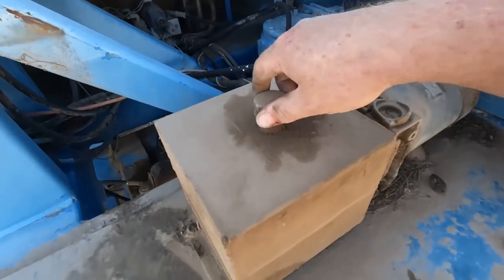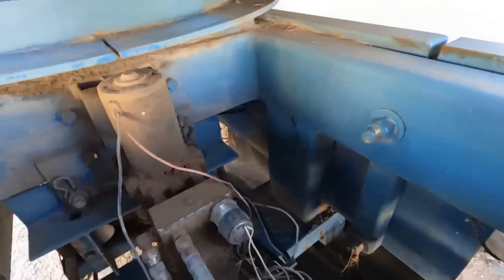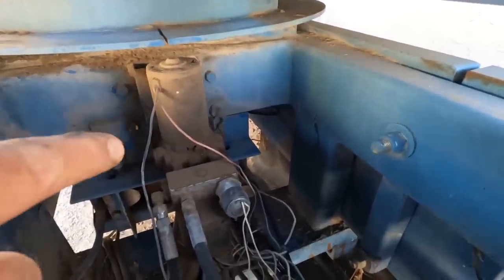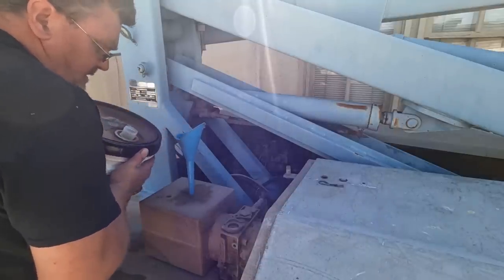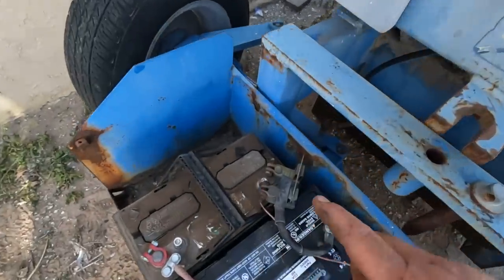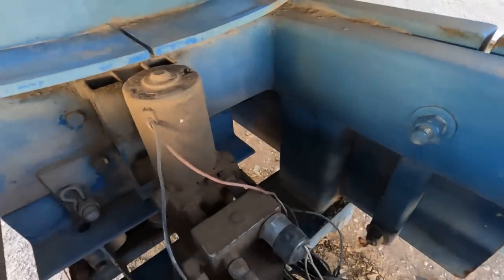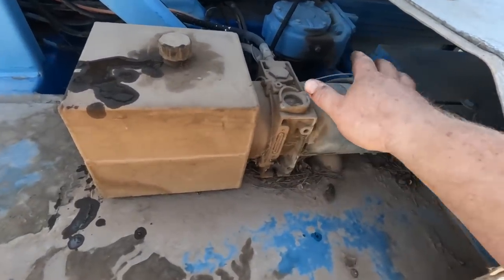This is the main hydraulic pump and tank — nothing on the stick. That little motor is a disc brake for the drive that automatically stops when you're not driving; it needs to be pressurized in order for you to have brakes, so that's the first thing it does. I've got fluid all over the tank. Main power on, hydraulic power on — that pump is just running and not building up pressure. I'm going to try running the main pump and see if it needs to feed some through to feed that other pump.